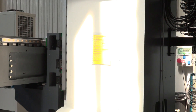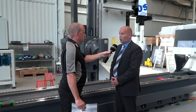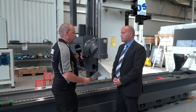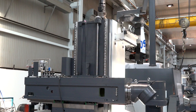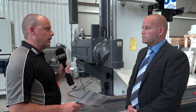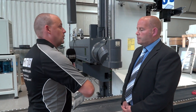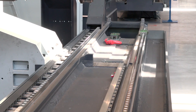So Ian, the Norma machine — this isn't the Norma L, what's the difference between the Norma L and this Norma? Mainly the configuration. This is a bed type machine, whereas the Norma L is a travelling column machine. It's good to see this machine with the guards off here, because it gives you a real insight into the fact that it's a two-piece casting machine and how the ram is supported. It does look like a rigid construction — very rigid, and a step up from the Xperta. Is this a bigger machine than the Xperta? It is generally a bigger machine.